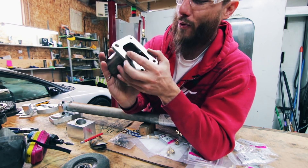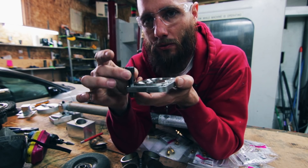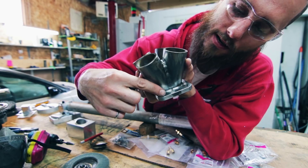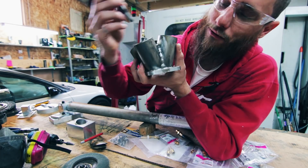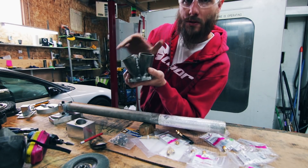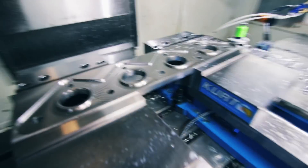The only issue I had was my in-position accuracy of the machine was set at 50,000 — it should have been set at like 2,000 — so it came in a little hot on some of the corners and ended up digging in a little bit. But it's fine. The collector after welding up meets pretty close, it came out really good. I'm about to start welding. The only issue I had — which I also had on the previous manifold — is where the bolt holes come down to secure it to the turbo, they get really close to the manifold and you can't actually get them in because they hit against it. So I'm going to die grind out that edge a little bit. You have to put the bolts through all four holes and then bring the turbo up, because you can't have the turbo in tight and try to get them straight down. Now I'm going to align this to the flange and tack it all up. This weld is actually super important — I should have back purged these ones, I was just more excited to get into the stainless welding.